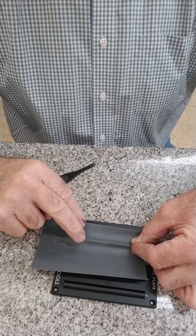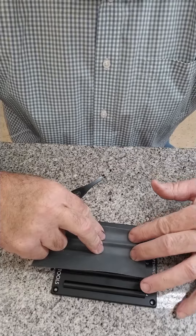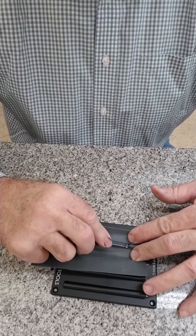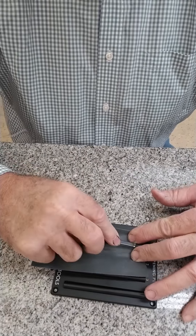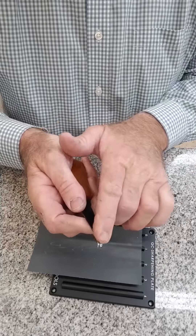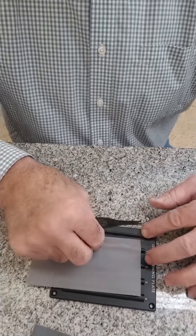Starting with the strip of 1200 grit placed over top of track number one, I will pick up my quick change number one western edger, drag it backwards and rotate while dragging it backwards. I'm rotating so I follow through the curve on the bottom of that tool.